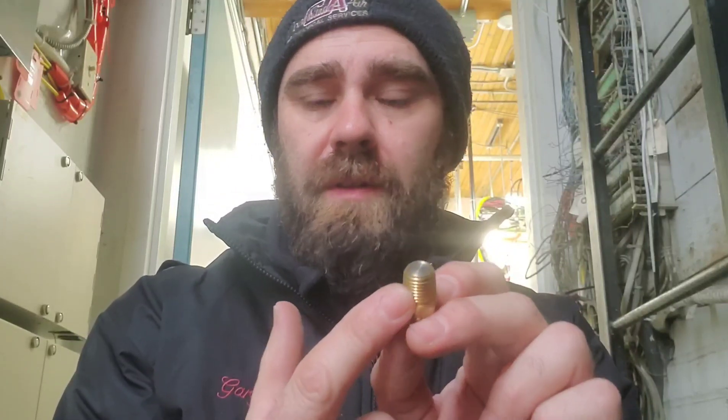This is a fitting that is filled with solder. That solder melts and basically blows the charge. This sits on top of the compressor — if the compressor gets overly pressurized, gets too hot, the solder heats up, melts, and blows the charge — basically acting like a relief valve. Carrier is calling it a snubber assembly, and I'm not really sure why that is.